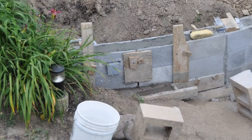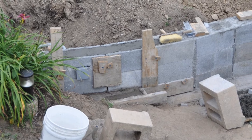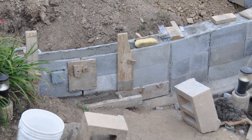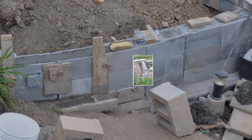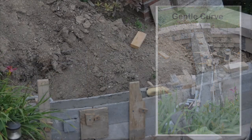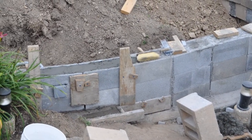The process was repeated again on the next section of the wall. Due to the slope, it only needed to be two blocks high. Again, a footer was poured, the Ivany block was stacked, the half-inch rebar was installed and tied together, and the curve of the wall continued. Scrap wood was used to bridge the gaps. As shown in this picture, the cores were filled with concrete.